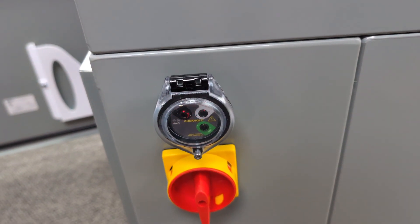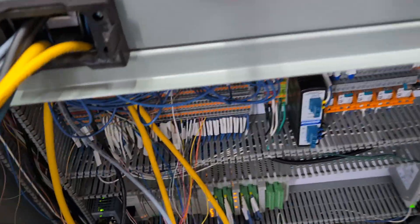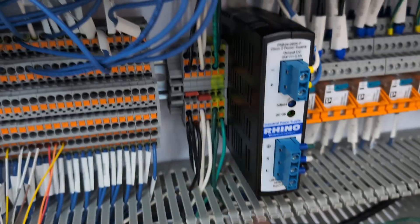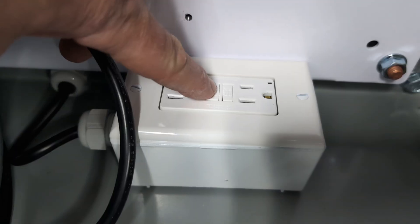All right, the little lights are twinkling. Pop the little blow-off thingamajigger. Oh no — it doesn't work. You don't have a ground hooked up to the outlet on the other side. Right here in the terminal — you should have another ground hooked up to the top. We send him to school, but he hasn't watched a lot of my videos, because all of you viewers know the green terminal blocks are bonded to the DIN rail, and that's how it gets its ground. I forgot — you've got to reset the GFCI when they're new.